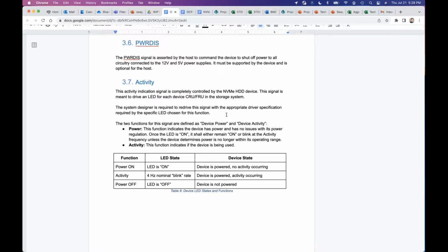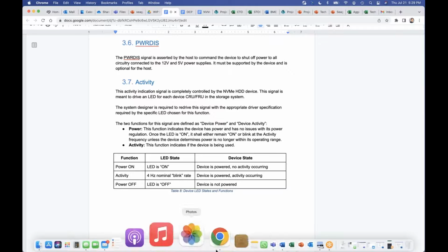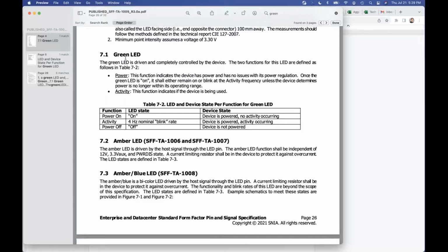What I would personally like to see is that all of that should be written somewhere, and I think that all of that is in other places, and as long as there's a clear connection that says the relevant section in this document is applicable for this usage, then that's okay from my perspective, because I know that a lot of that material is, for example, in the SATA specification, and I presume something to similar effect is in the EDSFF form factor specification as well. Right. As long as there's somewhere I can point to, either in the SFF committee or somewhere that contains the appropriate reference. Yeah, but we don't want to reference this spec because this is a spec for an LED on the device itself, and that's what concerned me about referencing it.